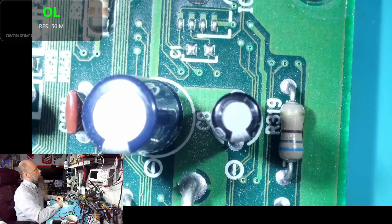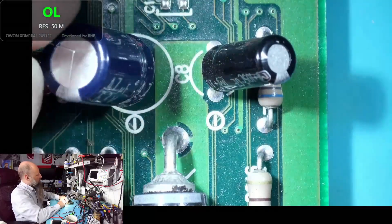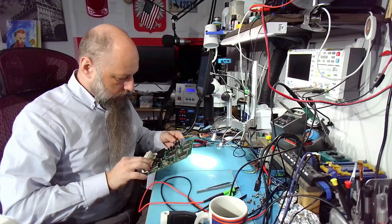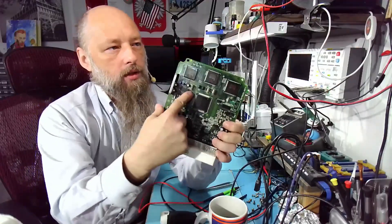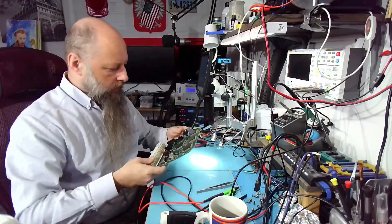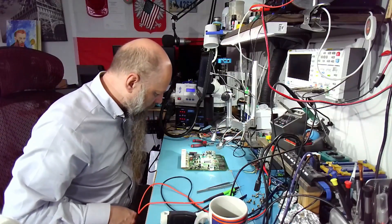These caps are 33 microfarad and 47 microfarad — I need to check if they're 105°C or 85°C rated. Let's get them desoldered, run the board through ultrasonic cleaning, and then confirm there are no damaged traces. Even from a distance with decent light you can see that something looks different around those two chips — almost like it was burned — but that's the electrolyte leaking. That was the main issue here. Let's desolder, clean, replace the caps, and see what else we can do.